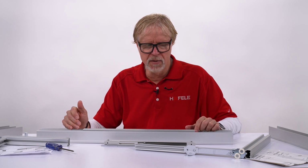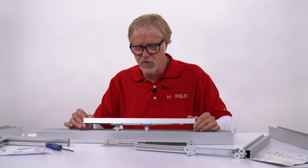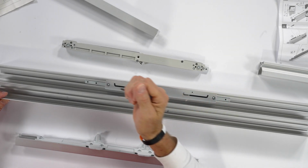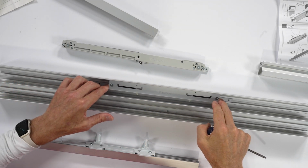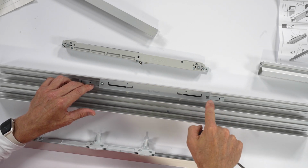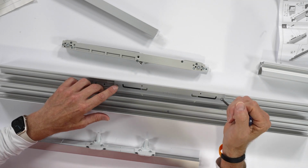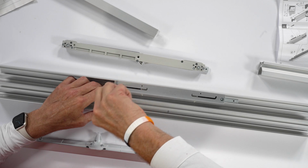The adjustments are made the same way as you do for the right or left soft closer, simply by moving the door out of location, loosening these two set screws. You can measure by a pencil mark on your upper track kind of how far you want to move it, and you can see into the track kind of where you're trying to put it. But let's just say that you need to move it 25 millimeters. You would mark it over here. You would then tighten this down,